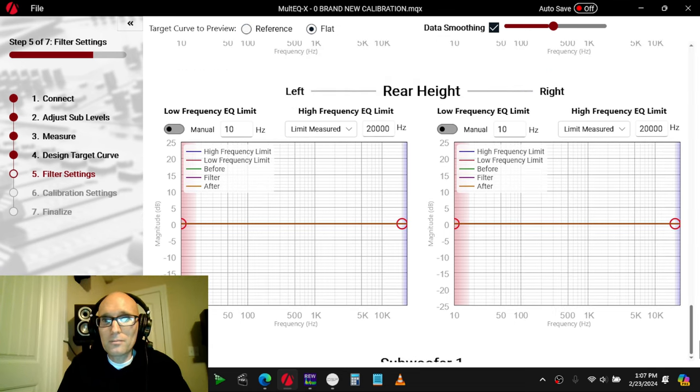So what is this, 90 something Hz. This should just be a flat line, but it's not, because it's optimizing over a range, which is why where you optimize to is incredibly important. We've optimized for, say, 90 Hz, but now the 30 Hz here is starting to suffer. So there is a balance to be had, and it depends what you want to optimize for. Think of this as a tilt. Do you want to optimize for ultra deep bass, or do you want to optimize for the crossover region at 80 Hz, but you do lose output at the bottom end.